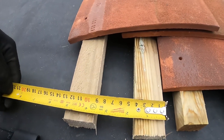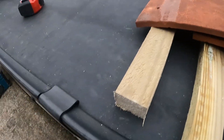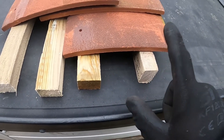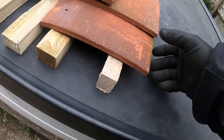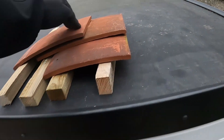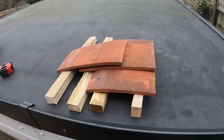This one is actually 90mm from top to bottom, but in our case it was 10 and a half. So as I was saying, you've got four battens to set out. The first one has to be thicker than the others to give that kick. If you don't have a kick, it creates a gap and potentially allows wind to get underneath. Hence why you want the first one raised — it means the tiles actually touch, so it's less likely wind would get under it.